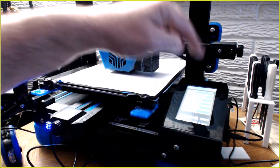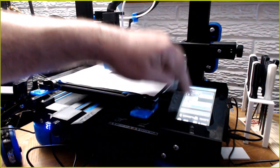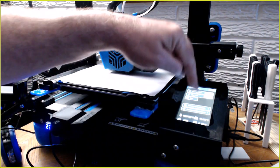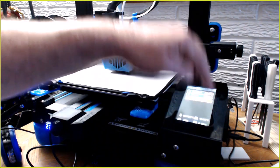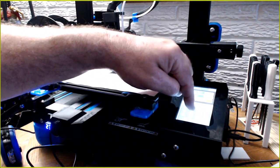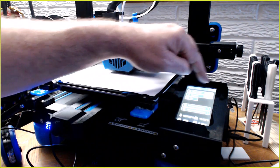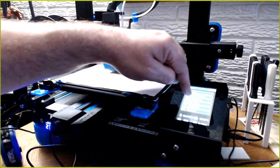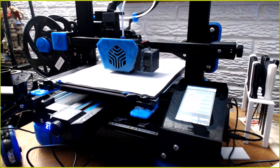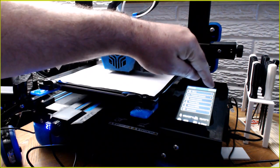So I'm going to preheat PLA. I don't like their settings. I'm going to need to go in and change those. Temperature, preheat PLA. For me, for the brand I use, 207 works very well. And bed temp 55. Click the red button that says Save PLA Settings. Back out of here. Back into Prepare, Preheat PLA, and my changes were saved. I know you can't see them with my damn screen. Sorry. Trust me, it's set where it's supposed to be, and it's doing what it's supposed to.